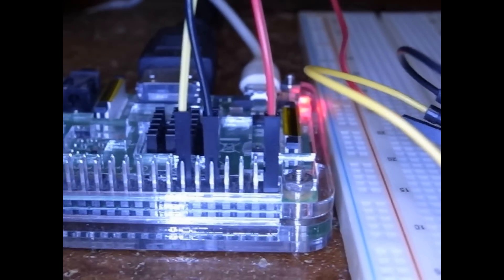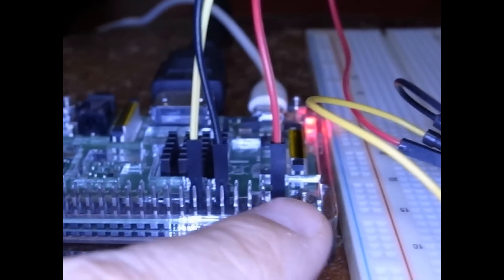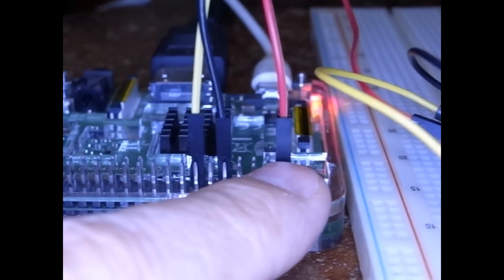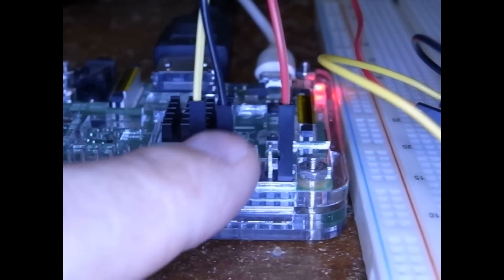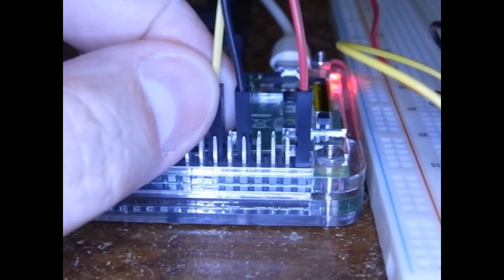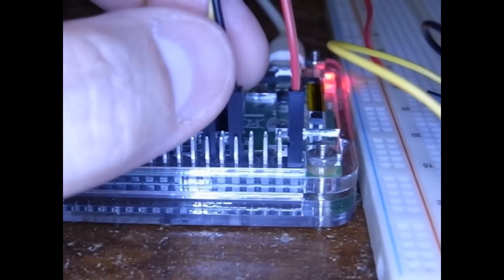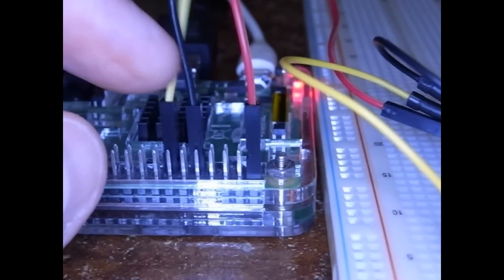Let's do a brief walk around on the hardware. Here's our Raspberry Pi. I've got the power connected to the 5 volt pin, that's pin 2, and then I've got the ground and the yellow pin — yellow pin is 13, and the ground is pin 9 if I recall correctly, but you can use any ground.